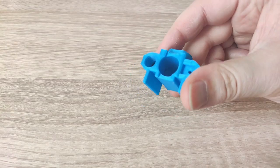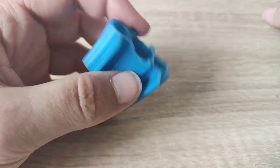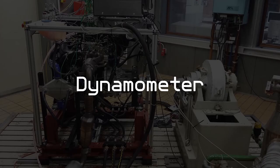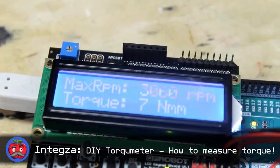In any case, now that I have a working engine, I figured I should try to find out how much power it outputs, in order to know if there is any hope in trying to use it to power something fun, like a small RC car. So I attempted to make my own dynamometer — or power meter — as demonstrated by Integza in a video linked in the description. The dynamo employs a simple Prony brake to measure torque through friction, and a photo interrupter to measure the RPM of the engine.